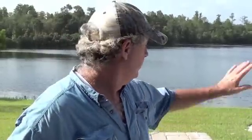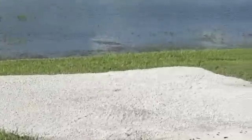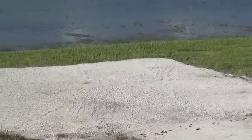We're leveled, we've got a grade cut in, we've got about 4 inches of slope in this patio so that water's going to drain away from the house no matter how hard it rains. We've got our second patio out there, it's pretty darn close to level, but it's not quite ready for brick. We're going to leave our sidewalk open now so we can get the bobcat on both sides. We've got to put some big trees in here when we start landscaping, but we're ready now to start installing pavers.